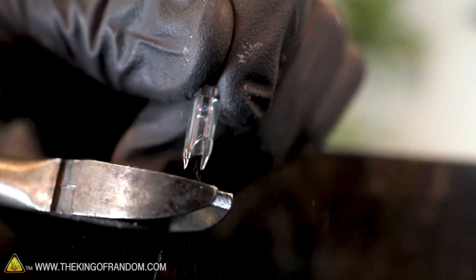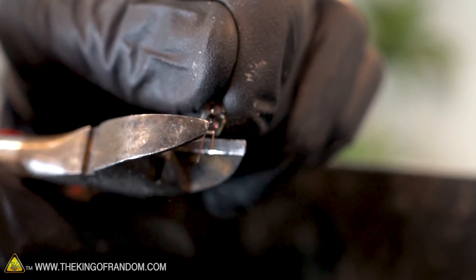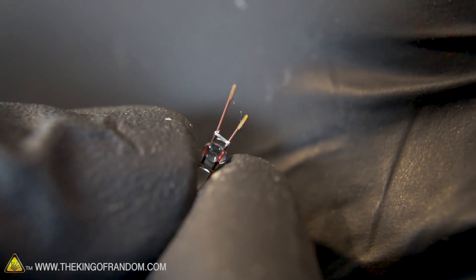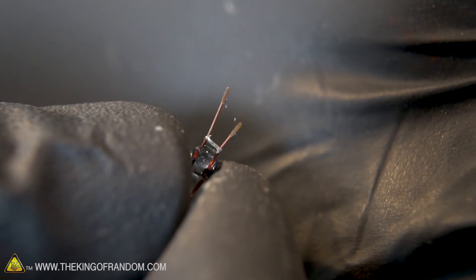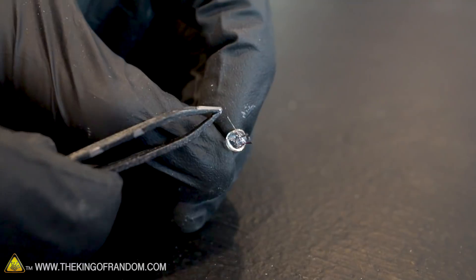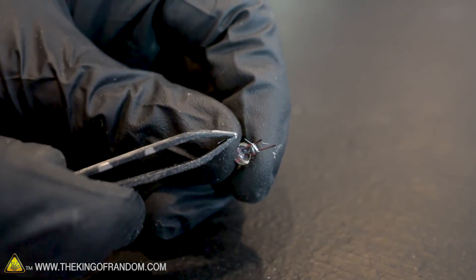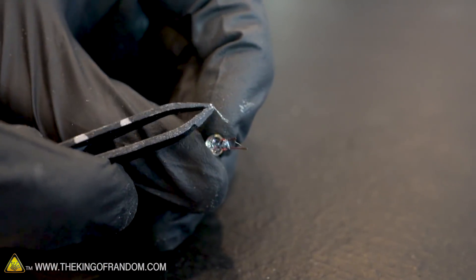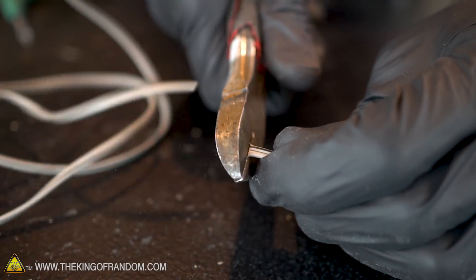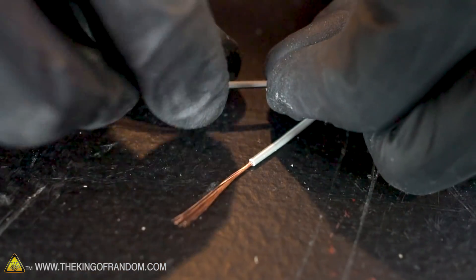Start at the top and very carefully break the bulb off using the wire cutters. It's easy to cut through the glass and into the wire, so you need to make sure you don't damage any of the wires inside. If you accidentally break the tiny filament, throw the bulb away and get a new one. In newer lights there will be a very thin wire wrapped around the bottom of the two copper posts — this helps keep your Christmas lights from going out in case the bulb dies. We need to carefully remove that wire. Our bulb is ready — now let's attach a length of wire to the back of it. Cut off a length of speaker wire about a foot long, split the ends, and strip three-quarters of an inch from all four ends.